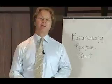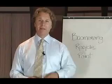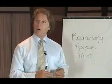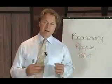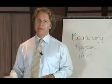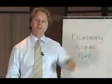And then we go park that drum in our warehouse. Next comes the production. Let's say we are going to be making light blue — that would be our 'cloud.' What we do is we ask the color computer where all the drums in our warehouse are that are close to or help make up the color cloud. So it asks us to go grab these 78 drums, which we do, and we pour them into a large tank.